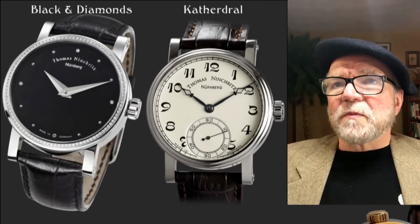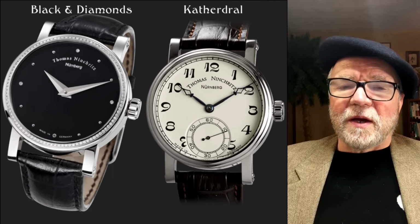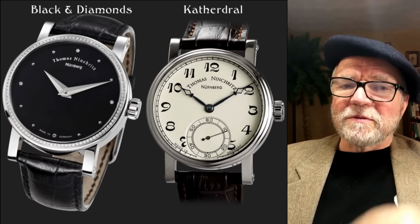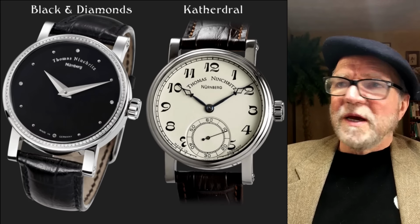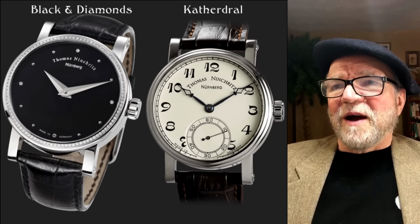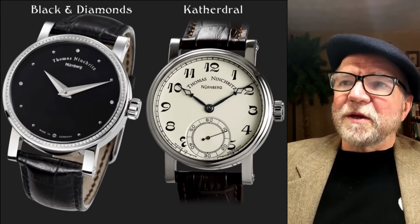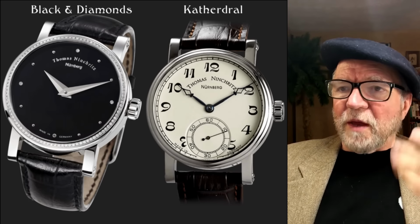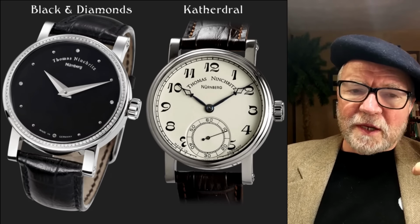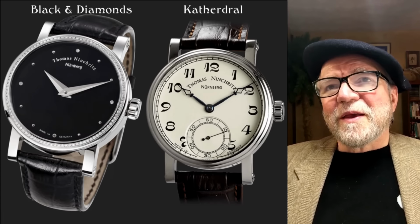These next two, Black and Diamonds and Cathedrals, I put them together to show the contrast between a very sort of modern Movado almost kind of look in the Black and Diamonds, and then Cathedral, which has a very traditional look. And I like them both. I really like the Cathedral a lot. The Cathedral has the 98, and we know that because it has the small seconds at the bottom, and the Black and Diamonds has 6497 because it has no sub-seconds at all.